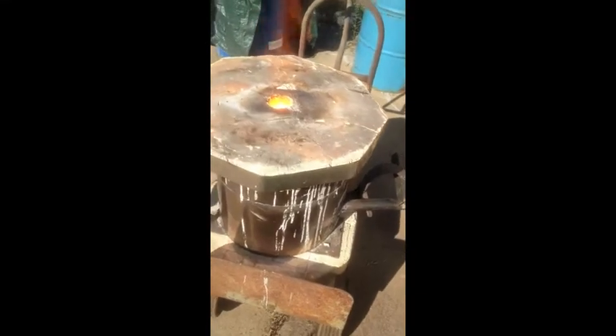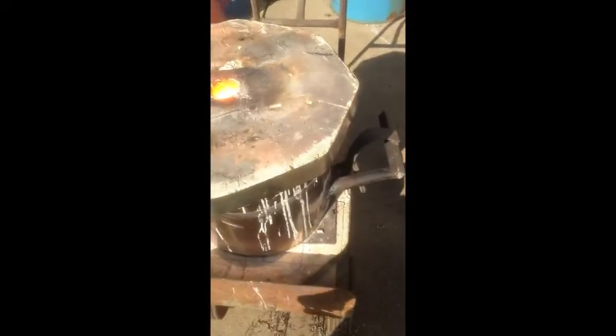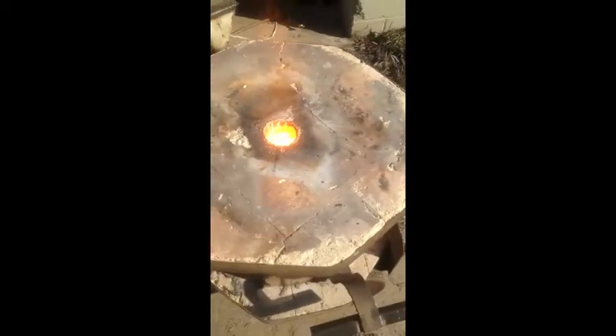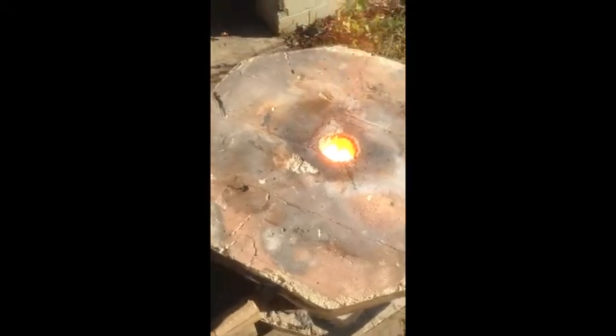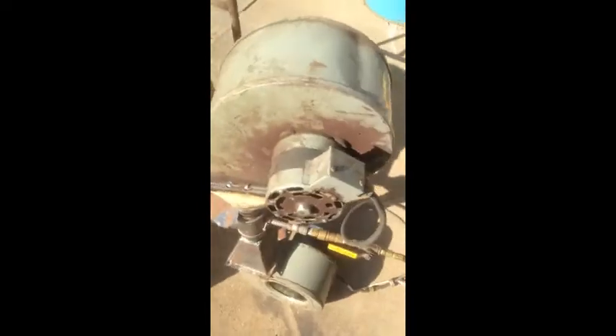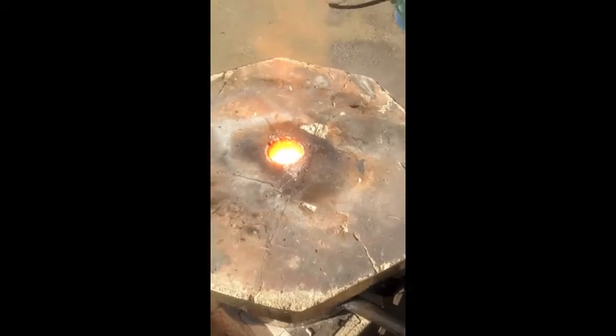We are just over one hour into the melt. A probe a moment ago with a mild steel rod indicates we are approaching full melt. The cast iron component had melted quite a while ago and the remainder is slowly dissolving. I went ahead and turned on the second blower and things seem to be working pretty well. Check in again in another 10 or 15 minutes.